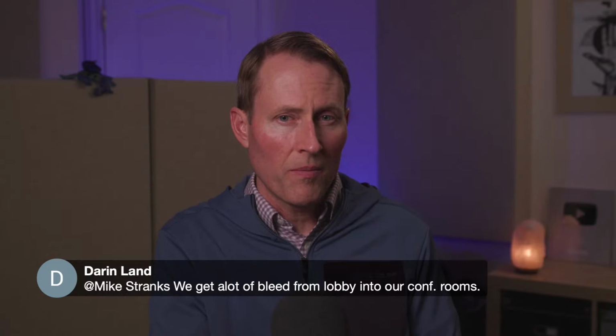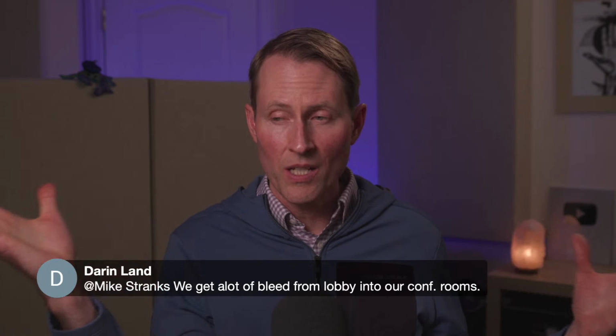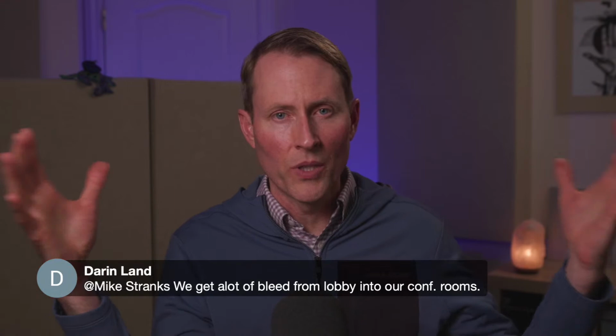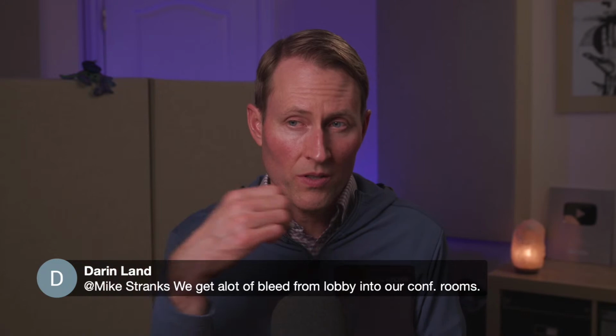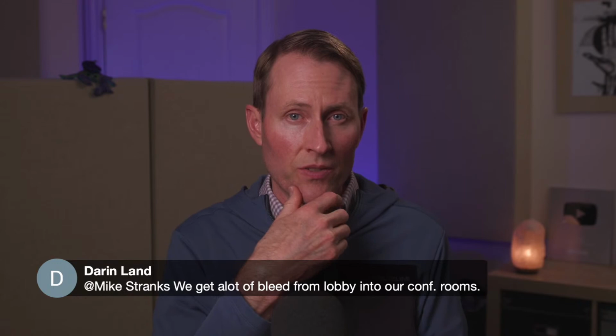Yeah, so it's important, I think a lot of people mistake the distinction between those two. The primary goal of soundproofing is to keep sound from either getting out of the room and bleeding into other rooms, or from outside the room bleeding into the room. So that's soundproofing. Acoustic treatment, on the other hand, is largely about optimizing the sound within the space, often for mixing purposes or for recording purposes as well. So acoustic treatment is different. So I think, Darren, it sounds like you're definitely looking at soundproofing.